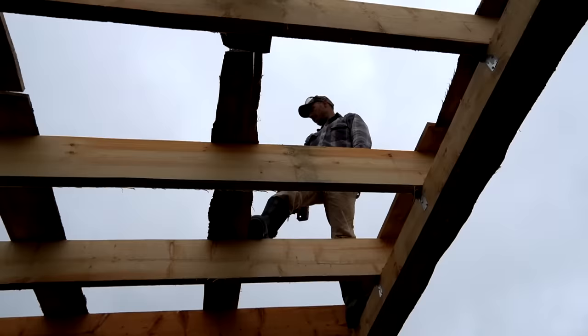Another wall done. It's not going too quickly, but we're getting it done. What we're doing is we're measuring a section, and then we're going over the sawmill, and we're cutting two logs at the same measurement. We're milling them, bringing them over, putting up the wall, and then we're measuring the next section, doing the same thing. These walls, since they're a little bit shorter, and we've got some good diameter to the logs over there, are taking a little under two logs to do. So I'm pretty confident that we have more than enough logs. The biggest section is gonna be this back section, because I believe this one's like 11 feet. This will be our biggest one, but we're gonna keep on working.